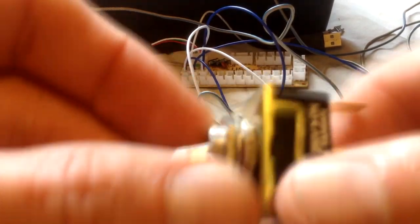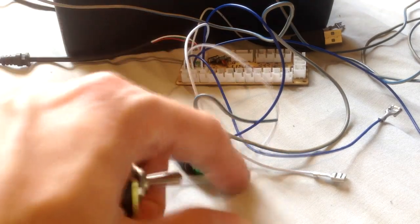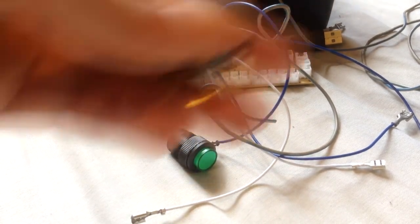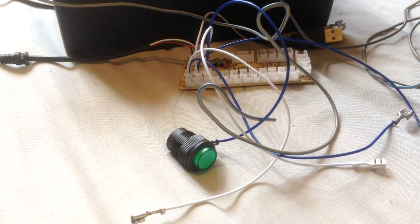And as you then move this switch, it breaks the connection and remakes the connection. So in a sense, you can wire up one single button off of that. So you can have the blue cable coming in on this middle one, and then wire one of these white ones to there, and then you're just going to need to use an extra bit of cable, like I said, just to splice into the other wire. So as you go from one to the other, the switch should always be in the on state there, and it'll break it and then on again. So it's just getting around the momentary aspects.